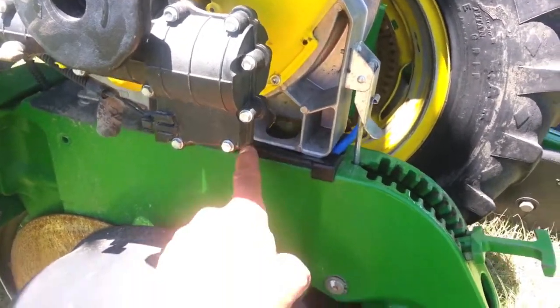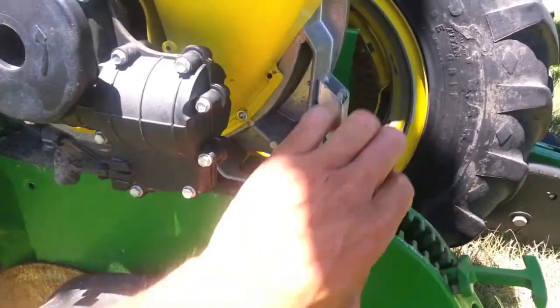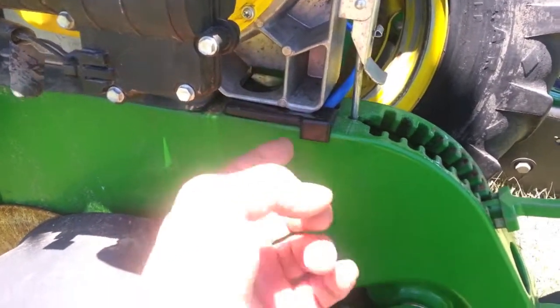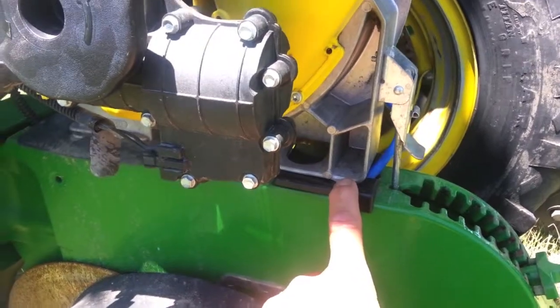On some of the older planters they have a metal tab here which helps clamp down and keep the tension on it to keep operations proper, but that tab will need some modification. These rubber boots are much easier than that metal tab, so consider this when you're considering the stainless steel tube.